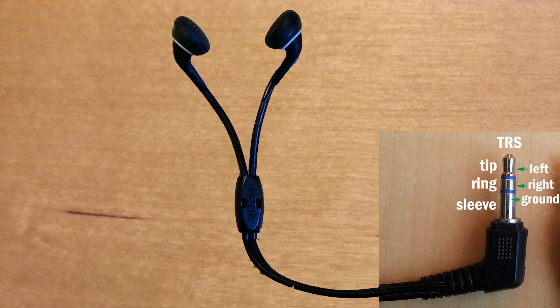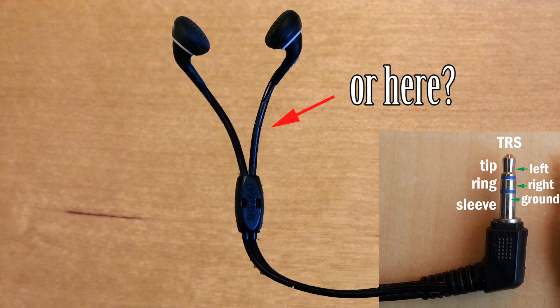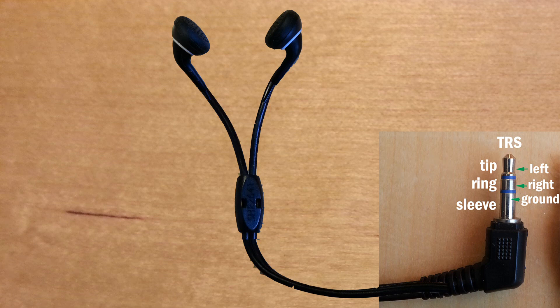What to do if the wire is broken further up towards the earbuds on either style — TRS or TRRS. You'll know it's broken or blown because there will be absolutely no sound when testing with the potato, and your resistance values on your meter will read open. If you want to save your earbuds, you could use a cheaper replacement set for the bottom end with the originals at the top. You will need to cut your wires near the top to test the buds individually using the same method. If there is still a problem, the earbuds are blown and you are out of luck. If your earbuds are $50, $100, or more, then it's an option well worth considering.